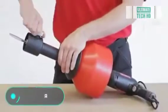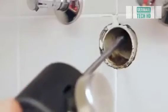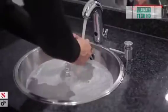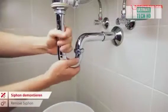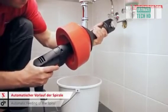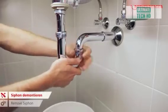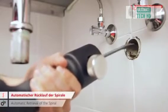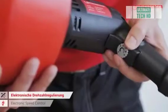Ross Bimatic — the next tool is an electric cleaning machine manufactured by the German company Rothenberger. The use of the Ross Bimatic is intended for situations where you need to unclog a pipe, with a working length of seven and a half meters. The machine works with pipes from 20 to 75 millimeters in diameter. Pay attention to the spiral-shaped detail — it has an unusual extended end which improves the efficiency of the work.